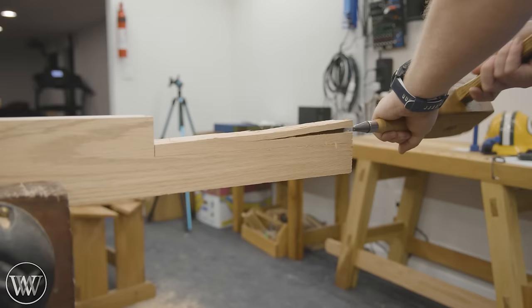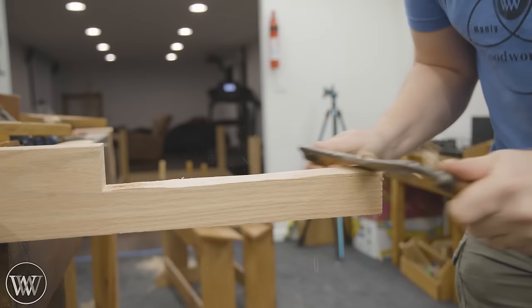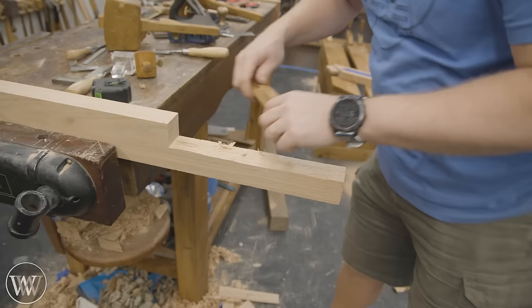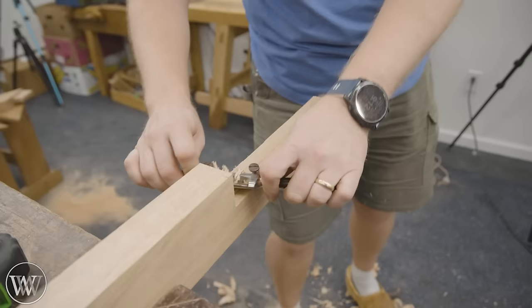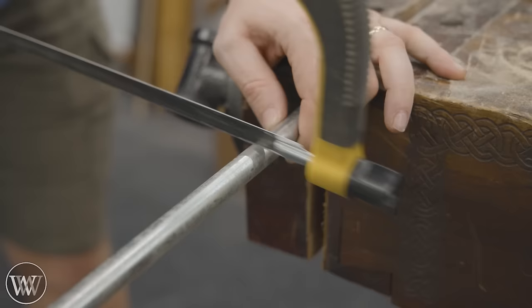This is enjoyable — knocking out these big pieces with good straight grain that runs all the way through. We're going to cut in about halfway down and let it run along the crack. You can see how it kind of straightens out as you take a thinner cut. Once we get down close to it, I'll bring in the draw knife and really go at it. This takes off a decent amount of material very quickly and gets us very close. Then I can come in with the spokeshave and clean that out. It's always nice to have multiple spokeshaves so you can find one that is actually sharp. That gets us really close, but thankfully this is large enough we can bring in the plane and smooth that out.